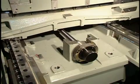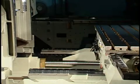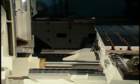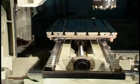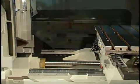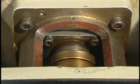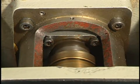Large diameter 45 mm ball screws and big size linear guides, width 45 mm, ensure the high structure stiffness during machining. Direct coupled servo motors eliminate motor backlash and noise caused by misalignment.